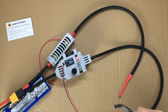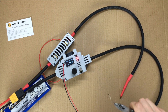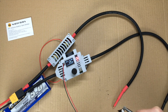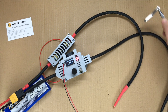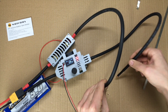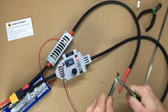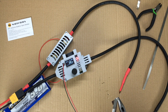Let's try starting out with a 10-millisecond pulse and see what happens. I was able to pull those apart with some resistance, so let's see if we can get a stronger weld. Going to 15 milliseconds — those are pretty strong. Let's try bumping up to 20 and see what happens. I felt like that was a stronger pulse there. That's a nice good weld — that one's tough to pull apart. Yeah, I'm having trouble pulling that apart.